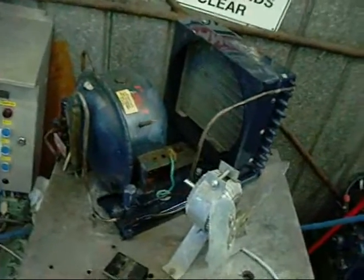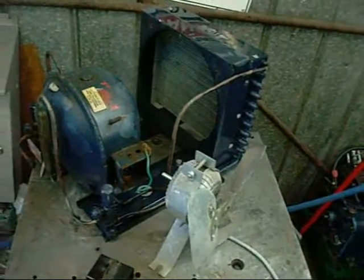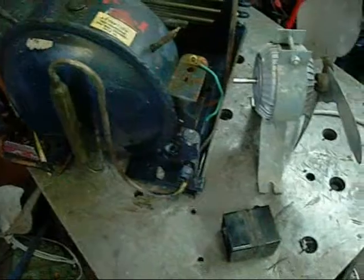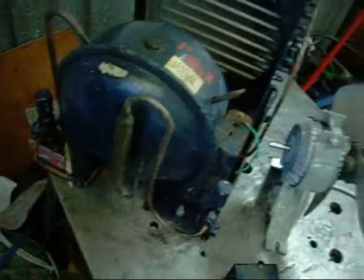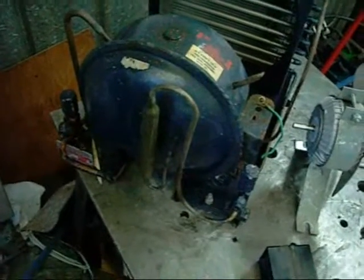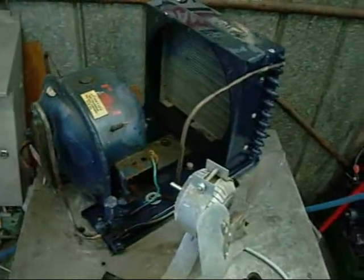Obviously some oil has been lost — there's been a leak down there which leaked oil. But you can get drop-in oil replacements and refrigerant replacements for old units like this one. This one used R12, a CFC. When I did cut the lines there was still about 1 or 2 psi of refrigerant in there, just vapour, and it pretty much kept the air out. I sealed it up immediately so there's no air in there and no moisture. But I'll probably end up needing an R134A canister desiccant dryer — not hard, I can get them easy enough.